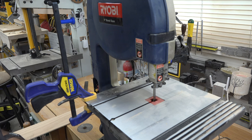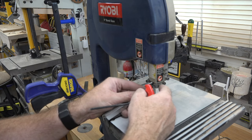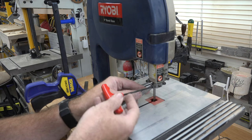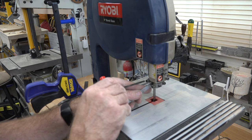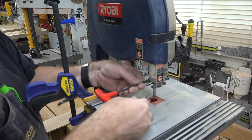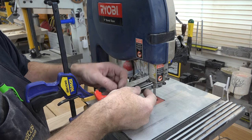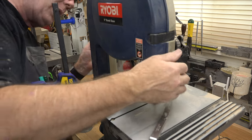I've got an old Ryobi here that has guide blocks, not guide bearings, and we can set this up in the exact same fashion as the larger saw. The first thing — 0.005 inches — we'll use the feeler gauge here and push the guide block in until it's set touching the feeler gauge against our blade, then do the same thing with the other side. This saw is completely out of whack — I backed off all of the guide blocks completely. There you go, that's up against the thickness gauge at 0.005.